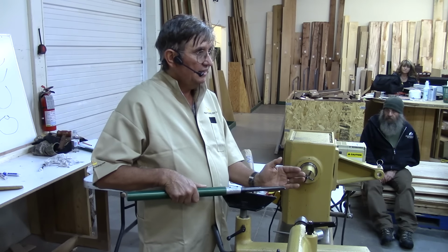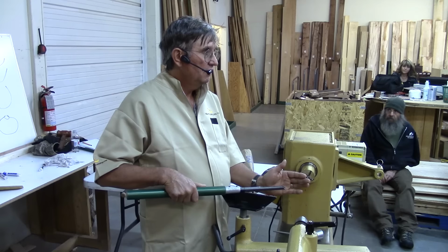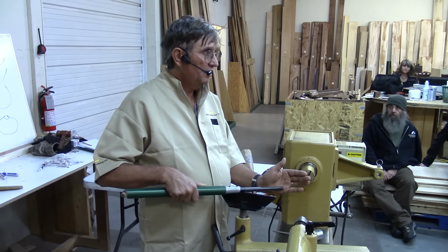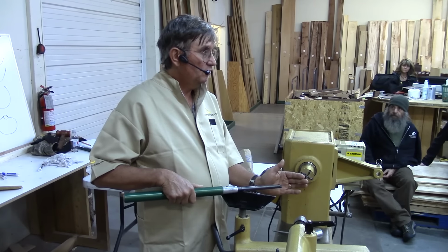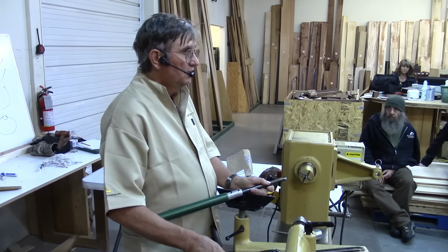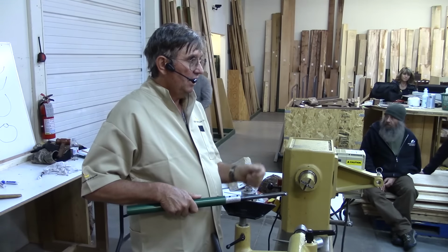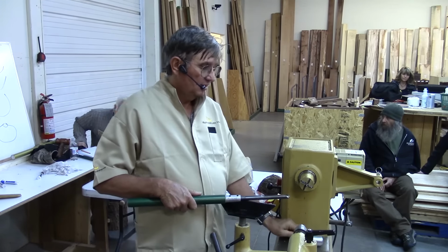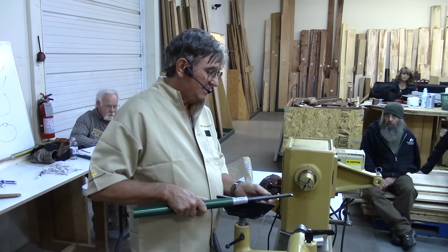And I think that one thing that we, as woodturners, don't spend enough time on is understanding how to sharpen your tool and getting it consistent. The sharpening is the biggest deal. My brother picked up some used tools that were this exact same tool, same steel, same flute. And the way they were sharpened, it was just crap. I cleaned it up and set it up the way it's supposed to be set up with this jig and made a good tool out of it again. He got them for like $10 and I spent $100. But still, it was a good deal.